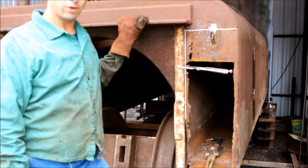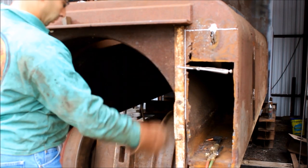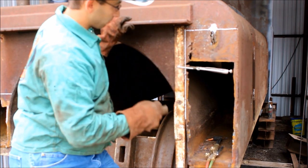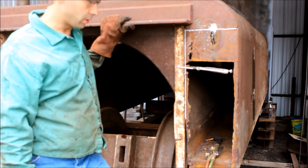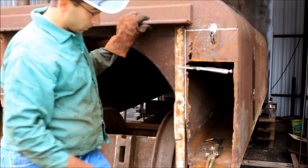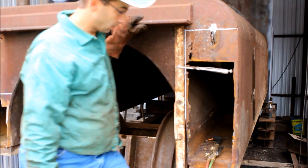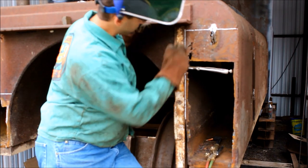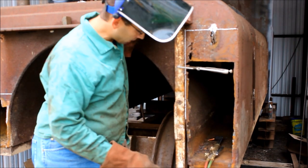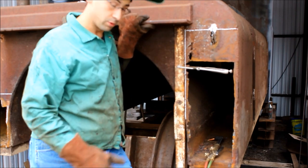Today we're working on the saddle tank for the J&L 58. This is the front of the saddle tank, so the big plate — the smoke box door — will be right here. On each side it had areas where it had been burned into before. Apparently when they took the saddle tank off the locomotive at J&L it was welded, so they just cut right through. We're getting a new piece of 5/16th inch plate, which is the thickness this was built to, and we're going to cut all this out, take that new piece of plate, stick it in place, and weld it in.